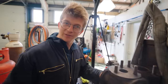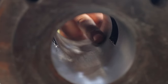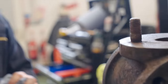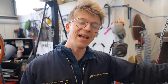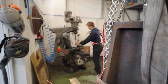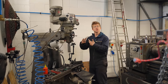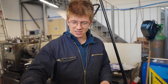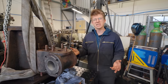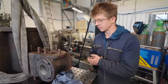About half a day later, I think we've got ourselves a polished bore — it does actually look pretty clean. There is a tiny remnant of roughness right here, but the rest looks really quite clean. Interestingly, when we were cutting with the boring bar the best cutting happened at the bottom of the cut — I think because when we were at the bottom, all the weight was higher up on the machine, creating a smaller moment arm for vibrations to twist and torque the machine, so less chatter and a better surface finish. We got to clean metal on the polishing way faster at what was the bottom of the cut. Anyway, this is a polished bore.